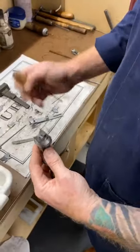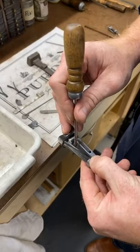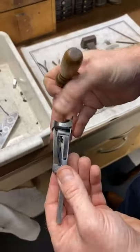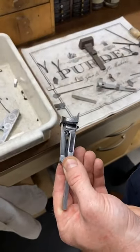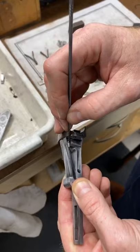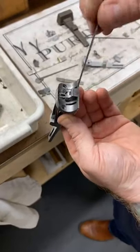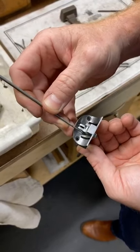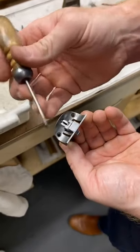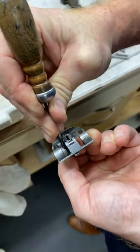So, what we have is a side spring in. It just goes underneath the mainspring to stop it from firing, because as the cam rotates, the mainspring is going to open up and then it's going to want to fire off the firing point. Let me just get a proper pointer. Off the firing point through here. The side spring stops that from happening purely because that's sat underneath the spring. Now, when the rod comes forward, it pushes this out into this void here, where you can see, which is another regulating point, like a half round, if you can see that. And what I'm going to do now is, you'll be able to see the movement of it. See the spring in that, so that goes back and forwards, side to side.